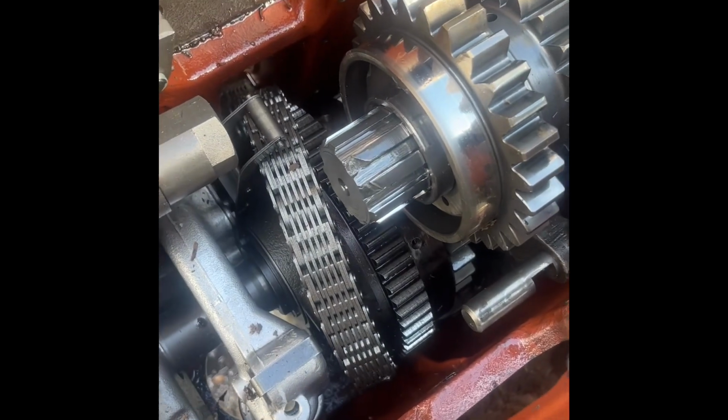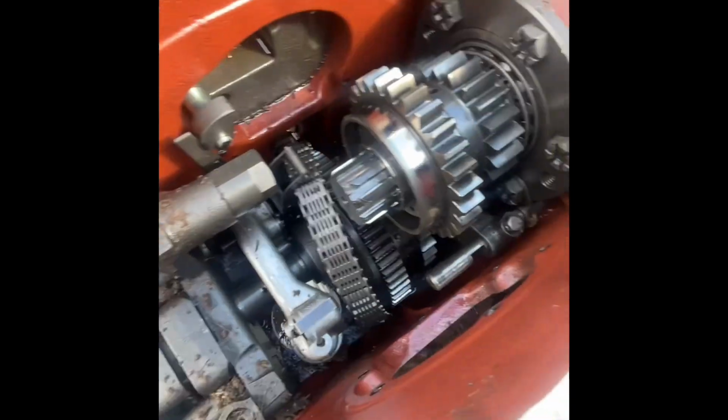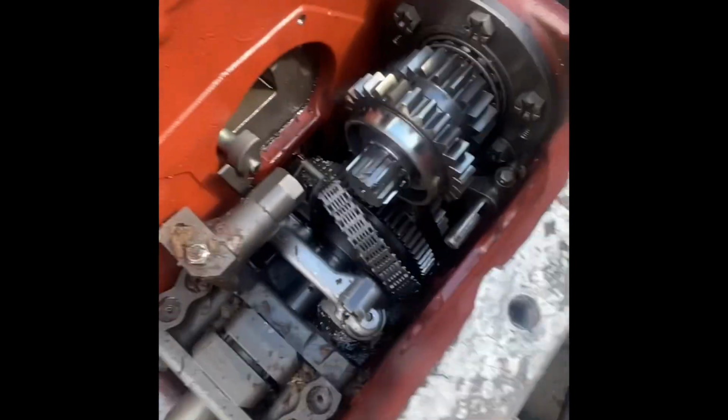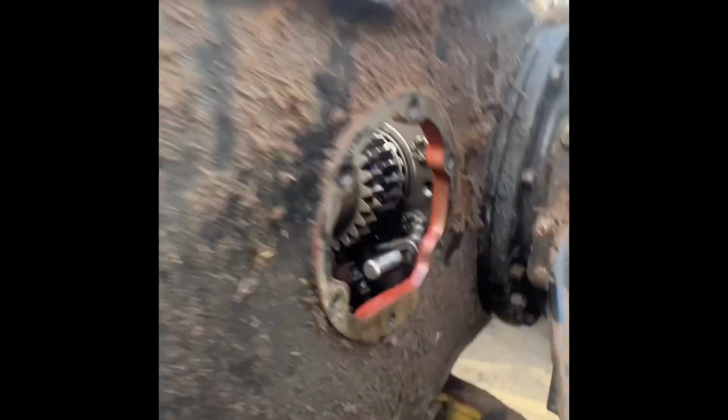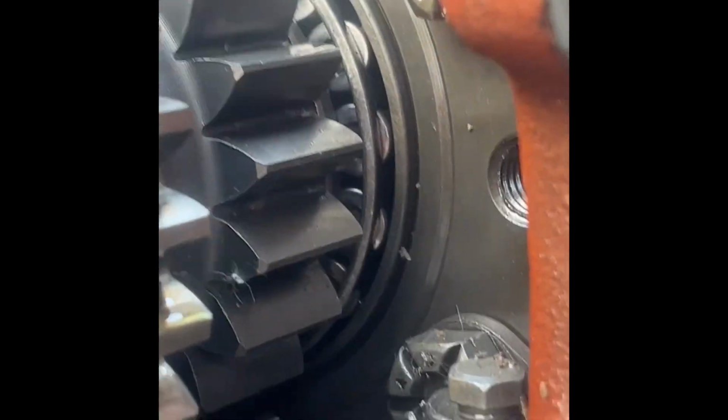Now this was a haulage tractor, I'd say, in Spain, because look at that, the end of the pinion, there's that chain moved as well. But that pinion shaft was loose on the shaft. You see the bearing there. Hold on, I'll zoom in. You can see just between the roller and the inner part of the bearing, the inner shell. Look at that, look, that's supposed to be tight.